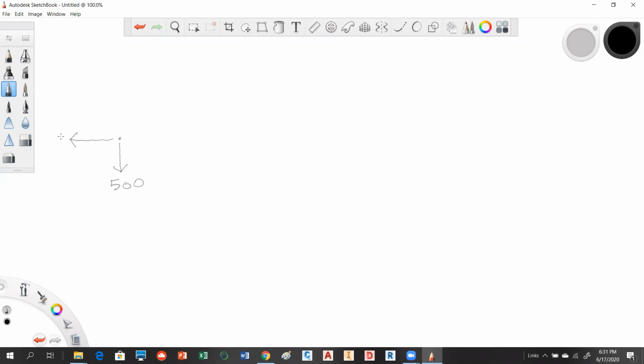That turned out to be a tension member. So since tension is away from the joint, I draw it away. Notice in the other picture it was going the other way, so you've got to flip-flop them. And we need to bring in that value, and we solved AB as 833.3 approximately. Then we have this vector and that vector. As we look at this, it's pretty logical. This vector right here, which is BD, has to be going up because it has to counteract that one, and this one has to be going right. So we're going to call this BD. We're going to call this BC.